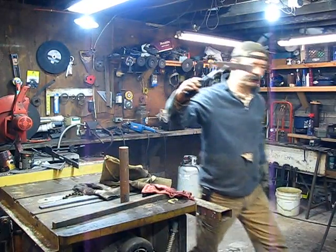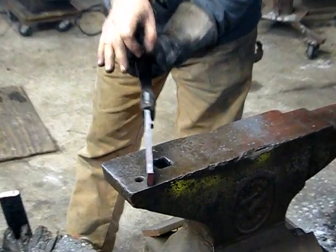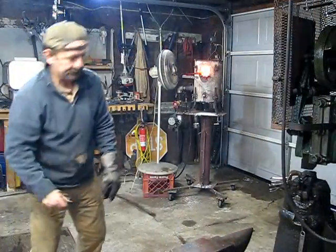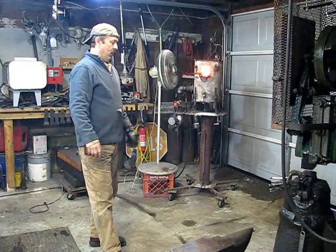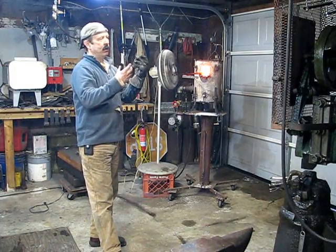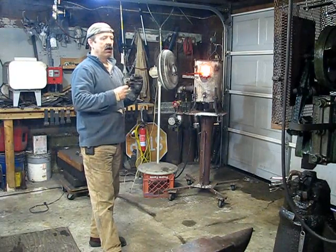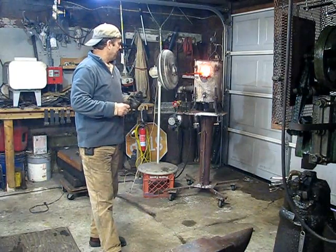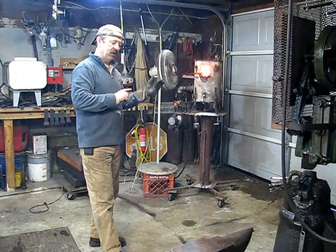Now here's what we have. That'll hold on to it. But you can see where we've tapered our blade down to the point. We've thinned it down to the cutting edge. We've got our ricasso set about where we want to be. And then we're going to do some what's called thermal cycling when it's all done. I'm going to imagine a piece of steel being full of crystals and grains, and they get all enlarged and oversized, and everything's in disarray. And with heat and a little bit of time, I'm going to put it back into a condition where I can deal with it later.